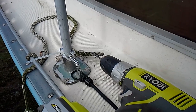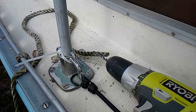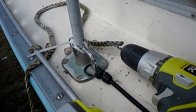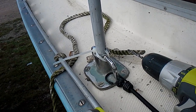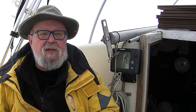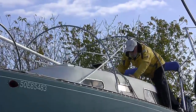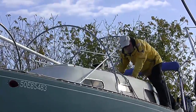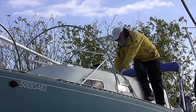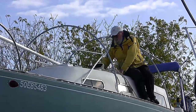I'm lucky because my conduit fits into my stanchion fittings. But if you don't have that, or it doesn't work in your case, you can drill the pipe and use zip ties. For additional assurance, I drilled and added zip ties anyway. The first step is to decide how many of these ribs you want along the length of the hull. Keep in mind, you'll be reinforcing them along the length of the boat and may also want to support them.